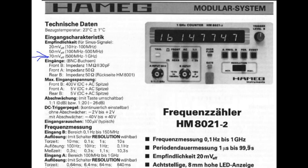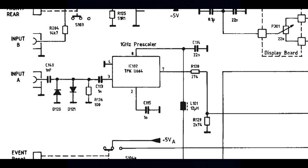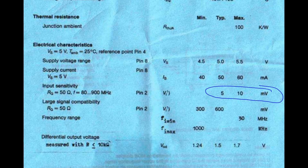If we look at the specification sheet, we can see the sensitivity in the 500 MHz to 1 GHz range — it should be only 70 millivolts. Here is the prescaler chip. It's shown that input A goes directly to that chip. If we zoom in, we can see this prescaler chip much better. This chip is called TFK U664. I was able to find a little bit of datasheet information, and it says it's a divide-by-64. It also shows the sensitivity for this IC should be between 5 and 10 millivolts in this frequency range.